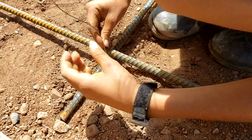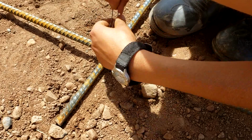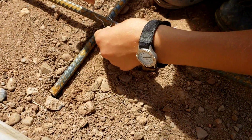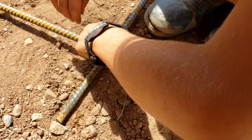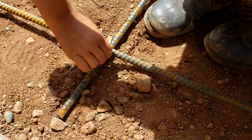This particular area, we're going to pour about 5.5 to 6 inches deep. We've got 2x8s here on the sides that we're using for framing it up, and that should give us plenty of thickness to hold, hopefully, a 3-ton, maybe 2.5-ton silo feed bin here with auger and everything else on it. It'll probably be a little bit more than that.